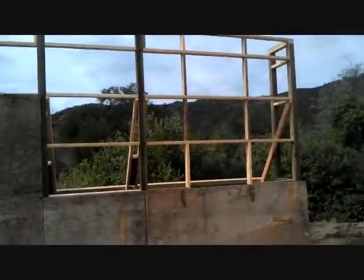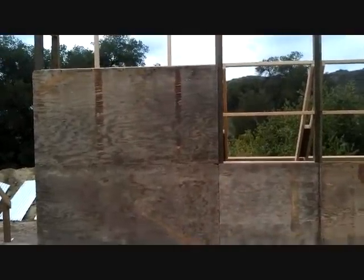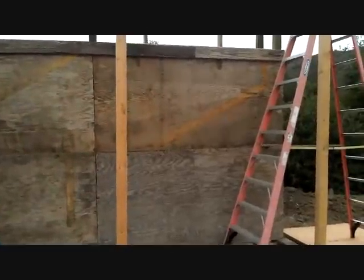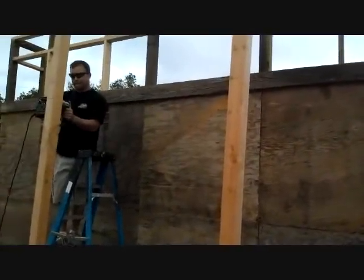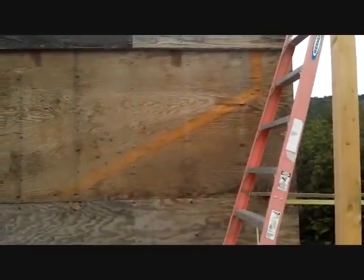It's morning. It's breezy. And we went ahead and skinned some of the plywood on. So hopefully we'll get this other stuff done fairly quickly, and then we can start working on the little porch roof. We skinned the other section we needed to, and we put a 2x6 up on the top, and that is going to hold the angle for the porch. We're going to put some galvanized metal up there. Anyway, make a little porch.